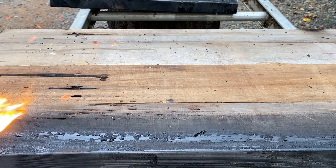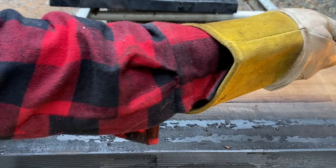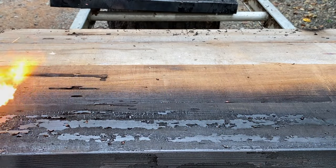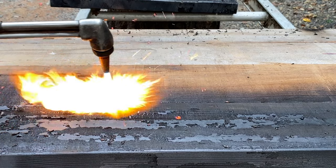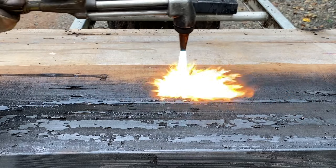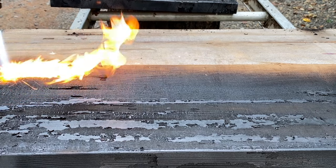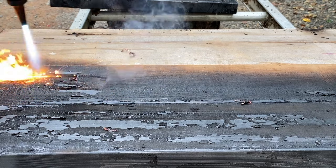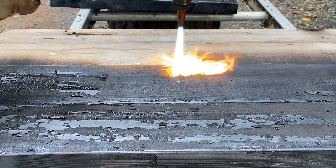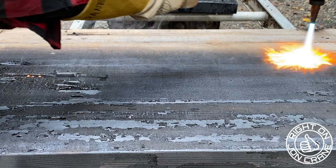Now, what I'm doing here is derived from the art of Yakisugi. I am using Western red cedar from the Pacific Northwest, and I am burning it with an oxyacetylene torch. You wouldn't see this done traditionally in Japan, although the process of Yakisugi has been adapted for use for interior finishes on furniture, which is what I'm using it for right here. I'm building a bathroom vanity. And I mostly like it for the color and the effect that it gives to the wood. It just gives such a beautiful look to the wood.